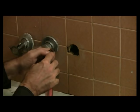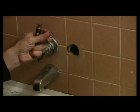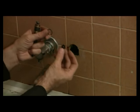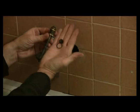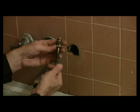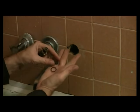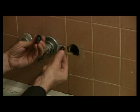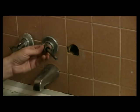Be really, really gentle because you can tear it, and you want to get the exact same size. I've got this ring and this end gasket — a flat washer — that I'm going to take with me, as well as the stem. It's really important when you go to replace these that you take all three pieces with you, otherwise it's only guesswork. There's nothing wrong with this stem itself, so all I'm going to do is replace the flat washer and the ring, and put in some new packing — graphite rope or graphite string, it's rubberized — pack it inside, then put the ring back on.